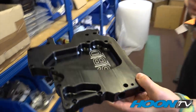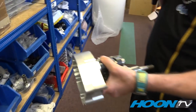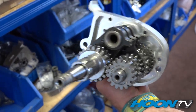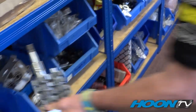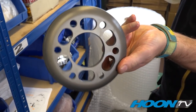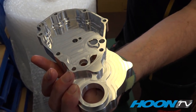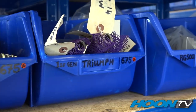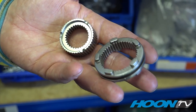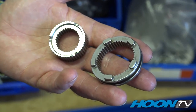Here's one of our billet machined sump assemblies, Hayabusa powered for the car boys. Here is one of our six-speed transmissions for a 1960s Triumph 5T — everything machined in-house bar bearings and bolts. Here we have one of our clutch baskets, hard anodised so it shouldn't wear out. A turbo scavenge pump that we manufacture for the drag racing boys. And here we've got our KTM Moto3 transmission — from the large sumps and big primary gears down to these tiny little dog ring gears, ready for Moto3 action.